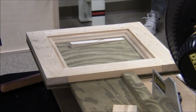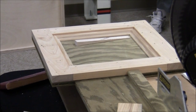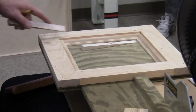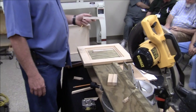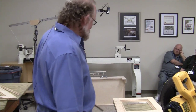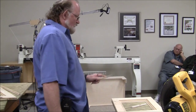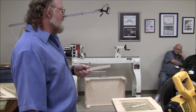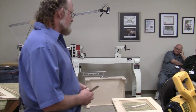As long as the glue's not left on the outside surface — it's in the crack and there's dust in it — you'll be fine. But if you leave it on the surface, you're going to get a white spot, what I like to call a ghost. The same thing with wood filler: if you don't get that wood filler completely off the surface, you'll leave a ghost. You don't see it until you get ready to put stain on it. So when your eyes are getting old, you really got to get down with that wood putty and make sure there's no ghost.